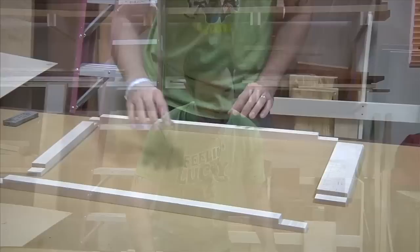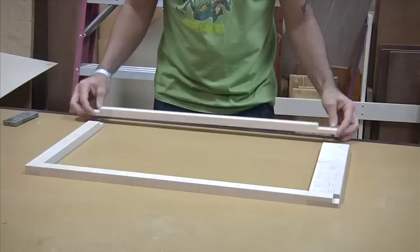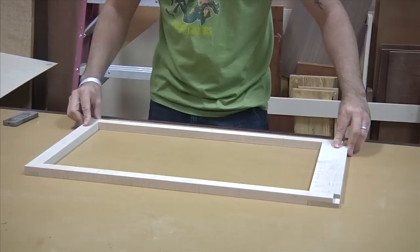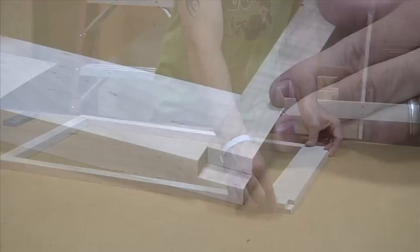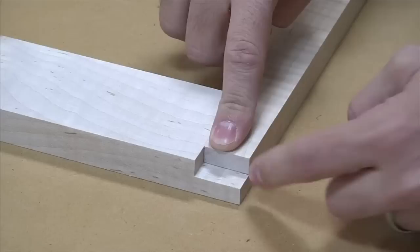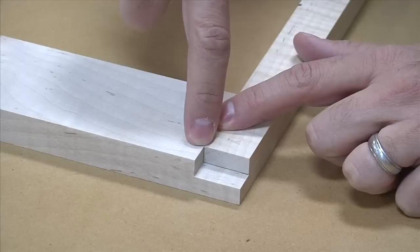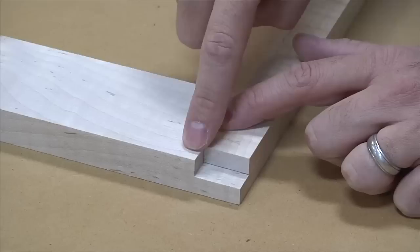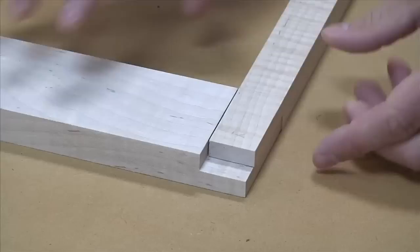Once that routing is done, it's a good idea to do a dry assembly — I like to call these sanity checks because they help show errors you might otherwise miss. Put the half laps together, everything looks nice and tight, and it should be square if our joints are square. One thing to note: at the top it might look like a mistake, but there's actually going to be a flat here — we'll remove some of this stock and then have a nice gentle curve at the top. That curve terminates at this point and flattens out, so we'll remove this stock later when we give the top that decorative curve. This is why the measurement is two inches even though our top work piece is currently two and a half inches.